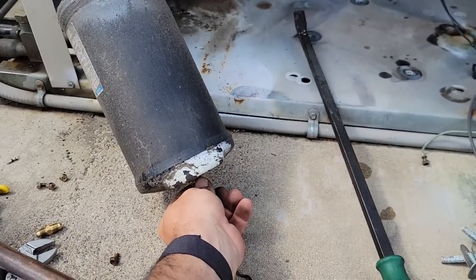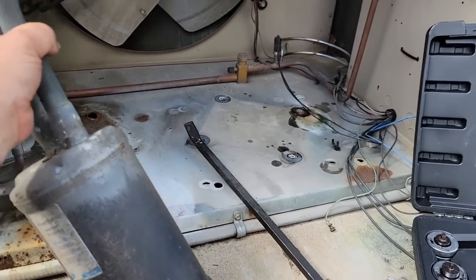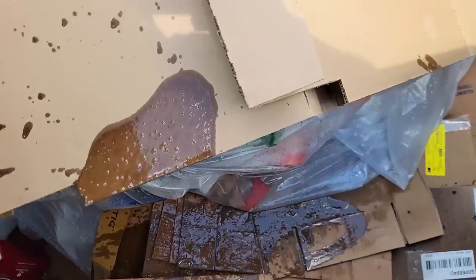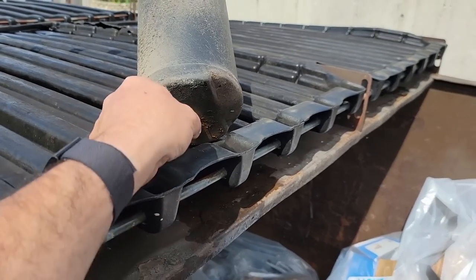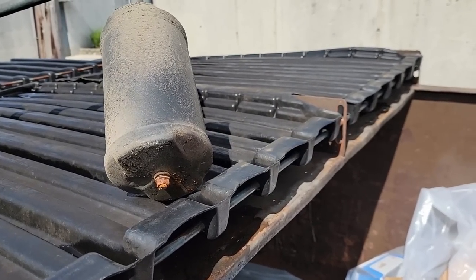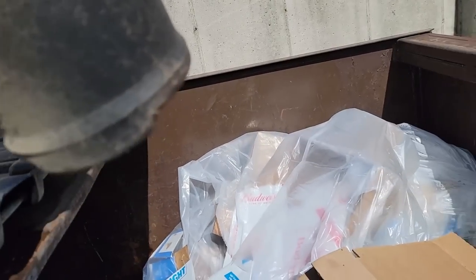Went ahead and pulled it through. I'm going to chop that off and shove it back through the hole. But when I was wiggling it back and forth, I noticed some oil coming out of it. Let's take it over to the trash and pour it out, see what kind of crap we get out of it. It don't smell burnt — I think we're probably going to be all right. The compressor would have been completely empty, it was a little low looking. It could have had a suction dryer on there from when it was factory installed.